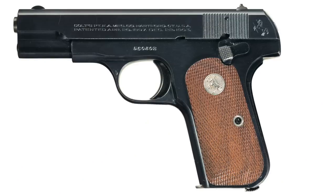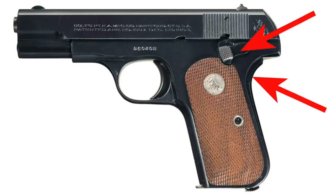The one place in these early Colt Browning pistols where you will find safeties as we would recognize them today is the 1903 pocket hammerless. That gun has both a grip safety and a manual safety. That's because there was no hammer for you to access to gently lower to the fired position or to leave at half-cock. The gun was called hammerless — it was actually a concealed hammer design — but you couldn't do that safety procedure on it, so it had to have some other style of safety.